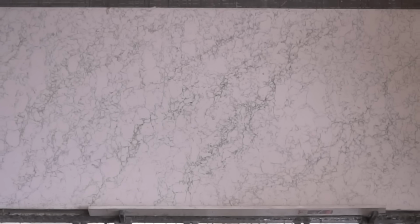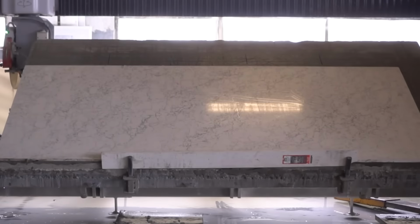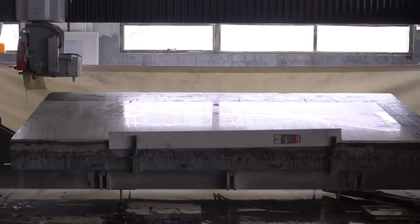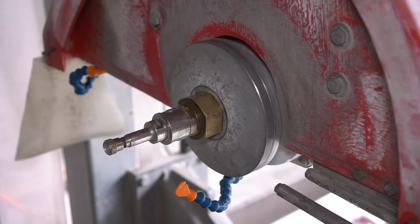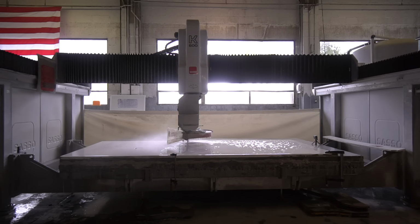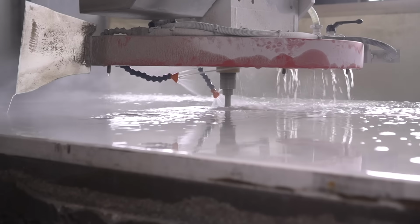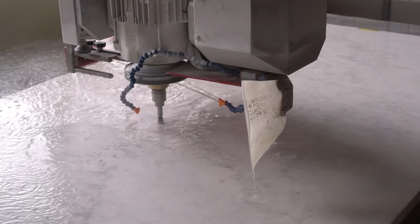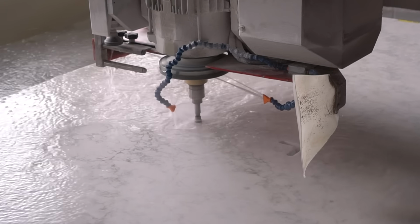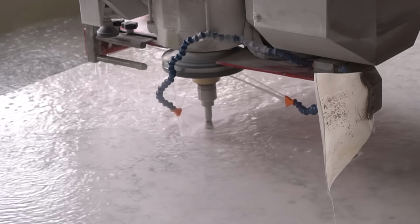We place our first countertop slab right on top of the table, and the hydraulic table slowly moves the countertop to a horizontal position. Our measurements have already been inputted into this machine, and therefore we can get to cutting immediately. The first device that's used to cut these slabs isn't even a blade. It more realistically acts as a plunge router because it slowly moves deeper and deeper into the slab while using a diamond tip to plunge into the solid surface itself.